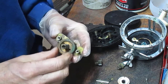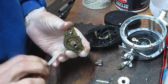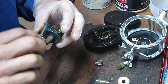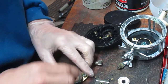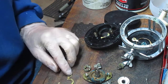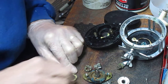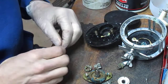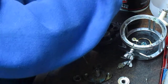This main gear is very, very dry, so I'm going to use some blue grease to get some lubrication on it. Back in the days when these things were well-made — this looks like it's a brass gear. I'm checking the teeth and lubricating it, and it looks perfect, actually. This is the collar; you'd see a similar collar in a Penn gear, a little bit different in terms of how the spool gear works. But this one's got accumulated junk on it, so that's probably why this thing wasn't free spooling well. I'm going to take the steel wool and pull off the excess grime. The collar looks good, so I'll spread a little blue grease on it to enable that spool gear to run well.